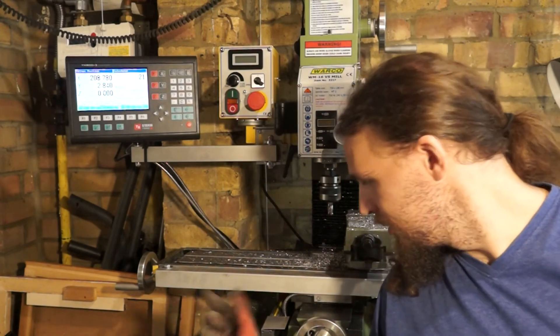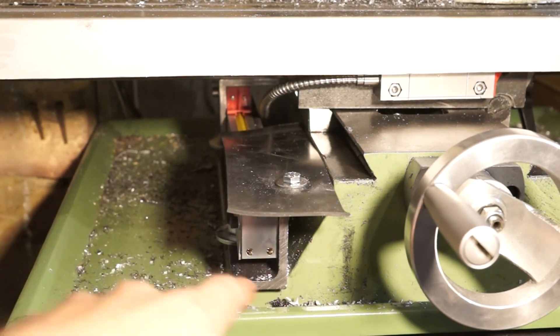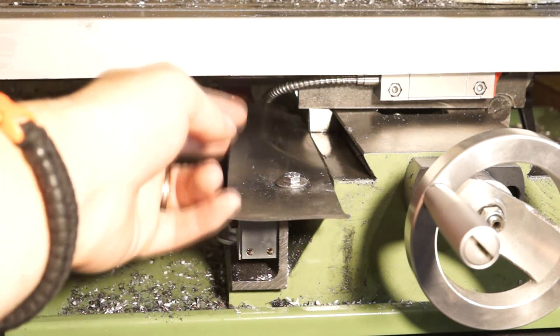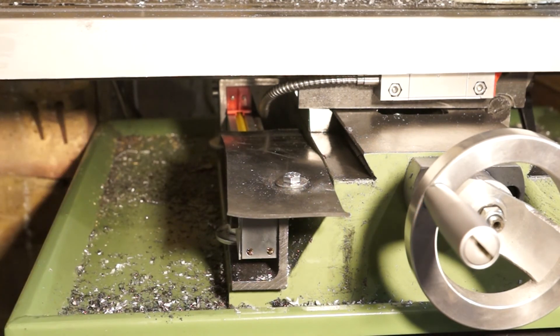Other than fitting this bit of rubber — which will only take a minute and I have actually got round to doing — it's a single bit of rubber drilled through to the aluminium bracket underneath, which extends quite a way under. As the table comes forward it just compresses up, so I might need to make sure it's clean before it gets compressed, just to make sure swarf doesn't fall onto the scale. But otherwise all good.